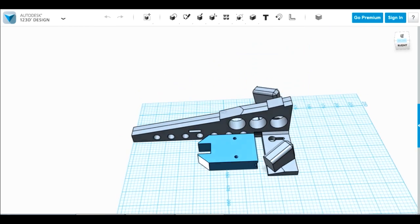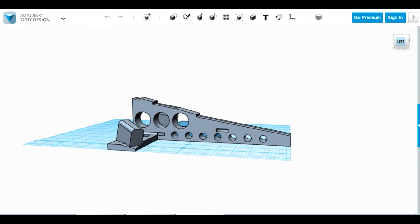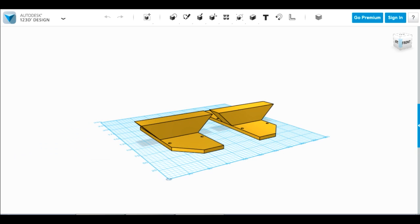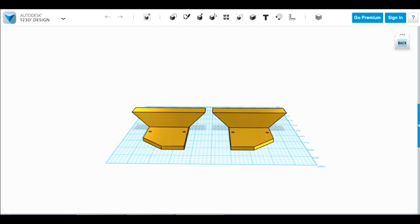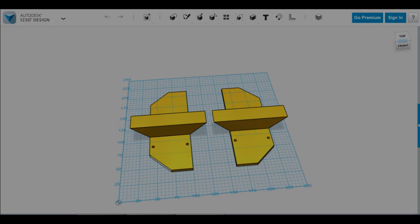Here are the parts I need to print — that's the T piece and its special holder at the bottom. I've cut holes in this piece so it's not completely solid; the holes relieve stresses in the build lines so the ABS doesn't warp as it cools, and also uses less filament. The other two parts to print are the two rib sections, which are symmetrical parts that will hold the cylinders and the red parts. Let's get those printed on the LulzBot TAZ and see what they look like.